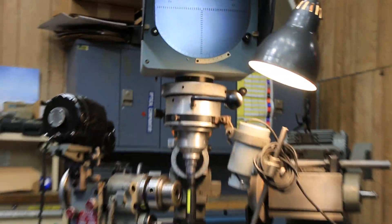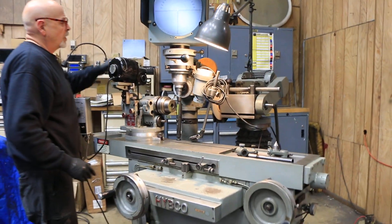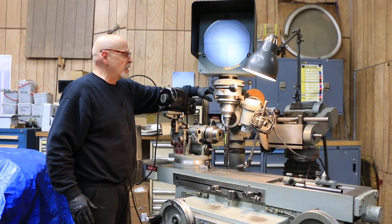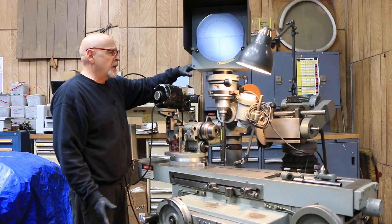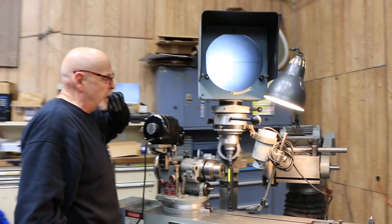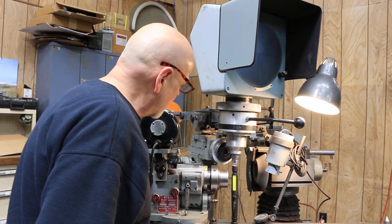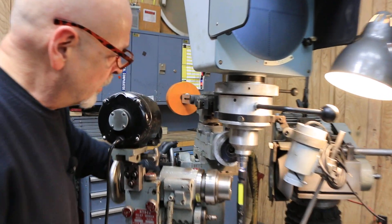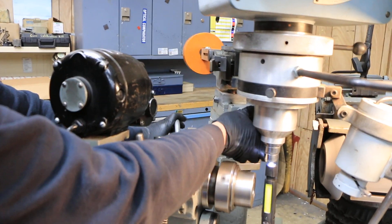This is the newer style of comparator where you have a bracket here with a pivot point and a locking pin — when you pull the locking pin out you can pivot this back up out of the way so you don't have it in the way. You also have a slide here with an x and y, or a y and z, and a finer adjustment up here.